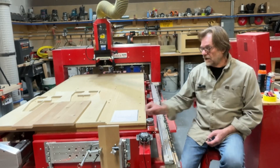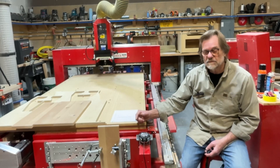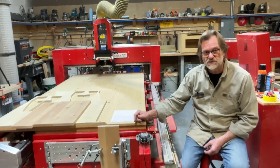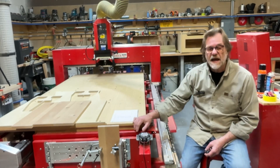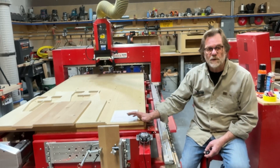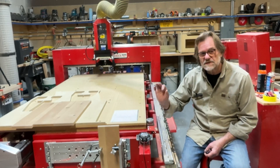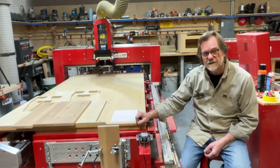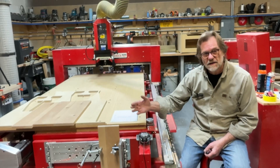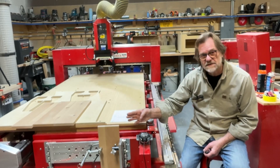So now we just got to find that point. I did this recently with a mechanical edge finder on the last drawers — actually the appliance drawers. I used my mechanical edge finder. The beauty of that system: it's less than 20 bucks. If you buy a name brand like Starrett, you're going to spend 50. They're usually worth it because they're a little bit more precisely built, a little better quality. But all it had to do was come up against the side, and as the two cylinders lined up and got close to the edge, they seemed to be one cylinder.